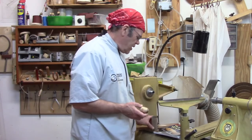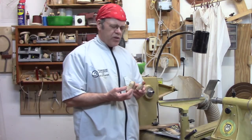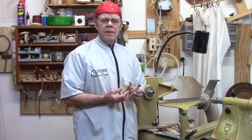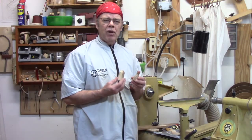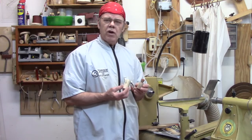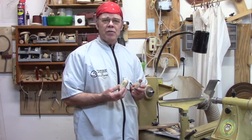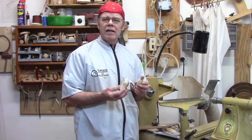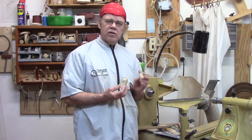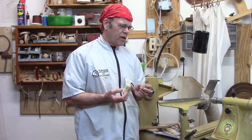You can use most any type of straight grain plain wood. I'd recommend things such as maple or cherry. I would avoid anything with prominent growth rings. A bland, colorless wood is better because it's easier to decorate, paint, and use markers on. So maple is good, cherry is good. Of course, one of my favorites is Bradford Pear — I always have a lot of it. It's very bland, somewhat colorless, maybe a little orange, but it handles felt tip pens well. We'll talk about decorating it a little bit later.